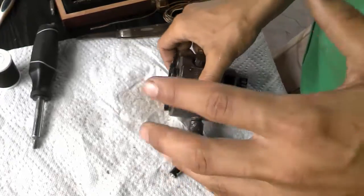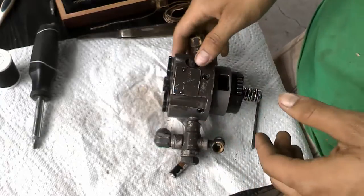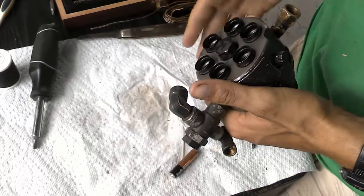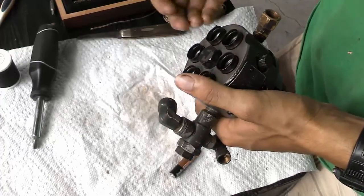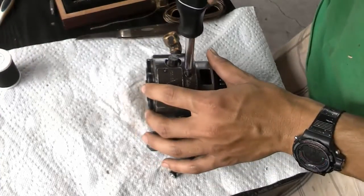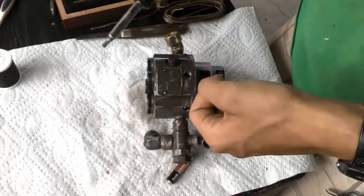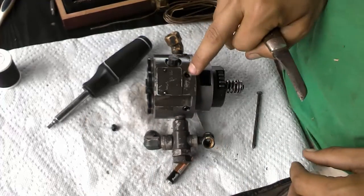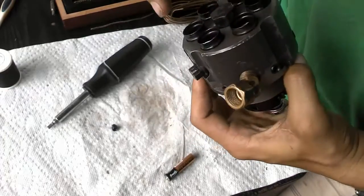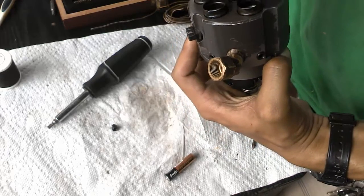We would start it on ether — it would run on ether about a second, half a second at most, and then she would suffocate and stall out. So we concluded that it was able to get fuel, but just not enough fuel to run on. So I took this out, figured out how to take it apart, took out these maintenance lines, and figured out that the maintenance lines themselves actually had clogs in them — at the very elbow of where the tube runs down through here into your main hydraulic head.